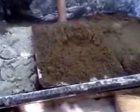This is a very crucial step: you need to dry mix this. Once the measurements are ready, I just leave the shovel in there and pour the bags on it, and you need to make sure that you have a good dry mix. You don't want to add water yet, because you want a good thorough mix. This small amount I'll just do by hand. It's better for presentation anyway, because I can talk. We'll make sure that it's dry mixed before we add any water, so that we can get our mortar the right consistency.